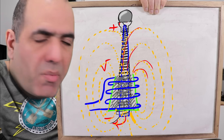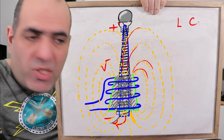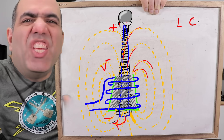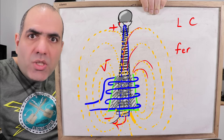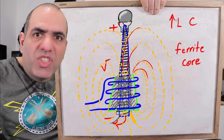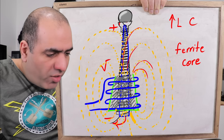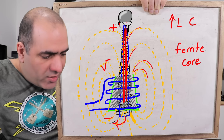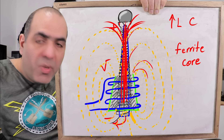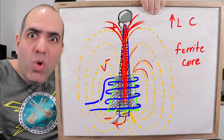But my dudes, I may not have much choice. The inductance and capacitance here might be so small that the resonance frequency would be too high to be easily drivable. If I use some sort of ferrite core, I can increase my inductance, which in return reduces my resonance frequency — easier to drive. Not only that, a core will focus the magnetic fields inside the secondary and further up the winding, which means larger energy transfer and hopefully a much larger voltage.